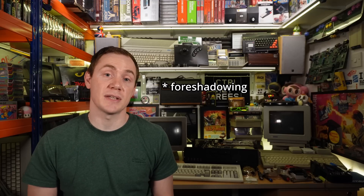One thing I really want to address is the power supply. As with most PCs of this era, the original one is inefficient and noisy, and if it had some kind of age-related catastrophic failure it could also have destroyed other bits of rare old hardware in the process. So let's get cracking on that, and finally start putting this thing back together for hopefully the last time.